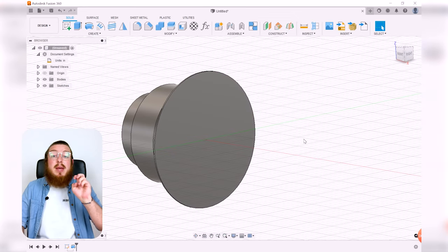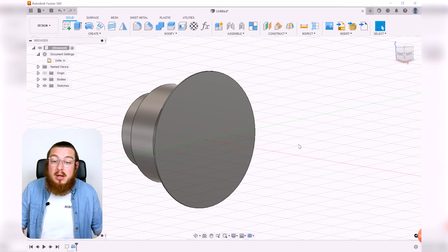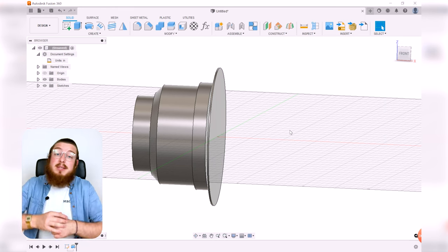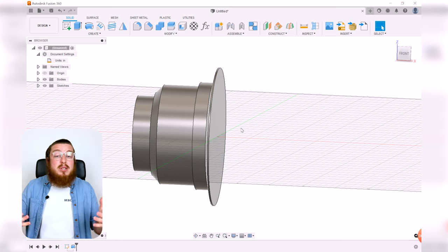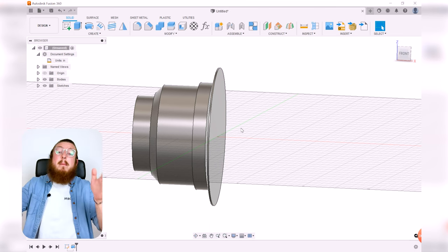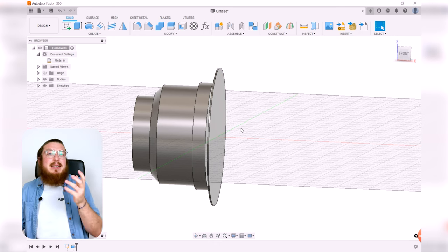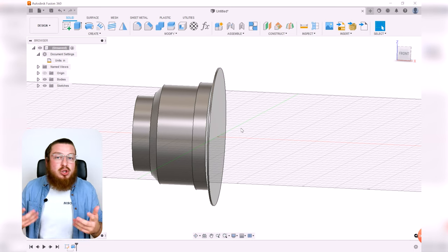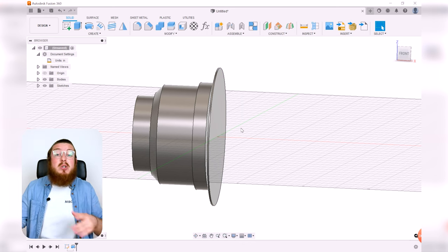So we're actually going to be doing a second sketch and then a second cut revolution. This is purely so that a person who looks at this part can say, hey, this is the outside portion, and this is the information for the internal portions. If you wanted to be even more efficient, you could combine both of these, but then your sketch becomes really densely populated with all of your dimensions and constraints, and it can be a little tricky to see what's going on. So if you want to, you can always split apart your sketches and features into multiple steps.